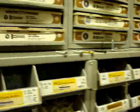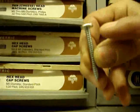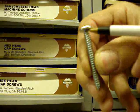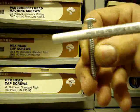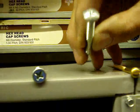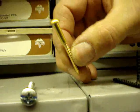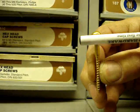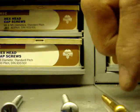Now, quite often people will take a screw and call it by the bottom of the screw. Quite often, this screw is mistakenly referred to as a flathead screw — that's not true. This screw gets called by what you see after it's installed. So here, after the screw is installed, you're going to see a panhead. Hence, this is a panhead screw. It's oftentimes mistaken with its originator, the roundhead screw. When that screw is installed, you're going to see just something round. So these are both commonly referred to as roundhead screws.